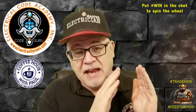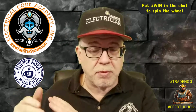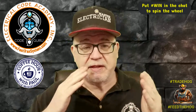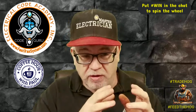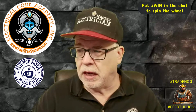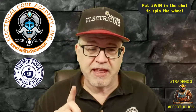Now, could I have the A's be copper and the B's be aluminum and the C's be copper-clad aluminum? Absolutely, as long as the ampacities correspond. There's going to be a difference in sizes, obviously, but I have to keep the same characteristics per set. Okay, so per phase set. But other than that, I encourage you to go look at 310.10(G) for that situation.